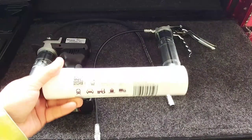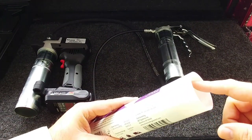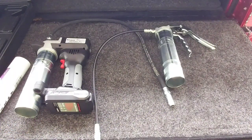The grease used in both of these systems comes in these plastic tubes — they don't have the traditional setup you might see with a normal paper or plastic grease tube. In most grease tubes you have to remove a cap off the back and the grease is fully exposed, so when you put it in the grease gun the plunger pushes directly up against the grease. That can lead to a very messy situation, and more importantly it tends to lead to leaked grease wherever you store your grease gun. In my case I kept my grease gun in the toolbox of my truck and there was always a mess of grease around the gun — I lost a tremendous amount of grease just from the constant pressure leaking out the end.